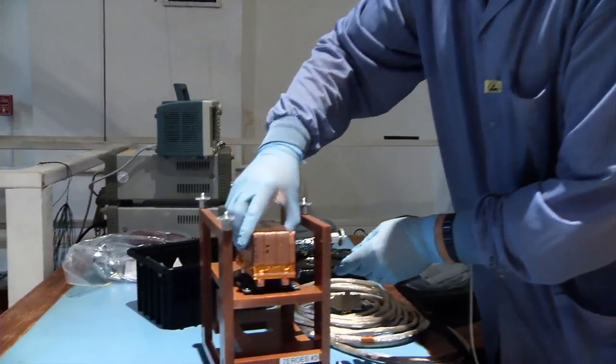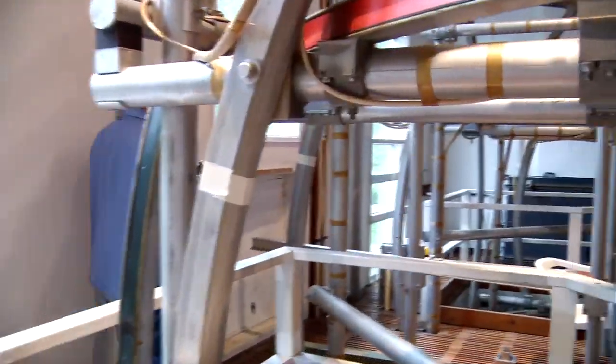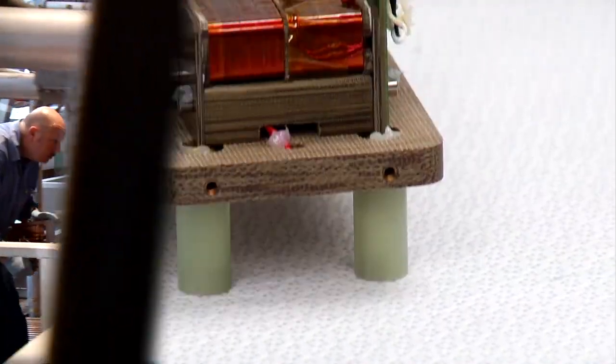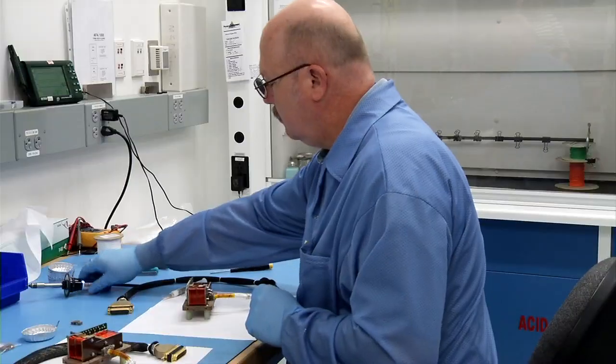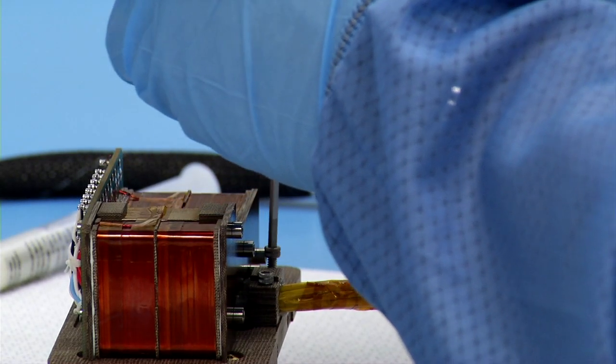The magnetometers, even though they're small, simple-looking instruments, there's actually a great deal of sophisticated electronics and testing and calibration that goes into building them. They're so sensitive that we ask everyone to use non-magnetic tools when they're working on them. Even if you had a tiny little fleck of metal that came off of a screwdriver, that'd be enough to be noticeable and detected by the magnetometer.